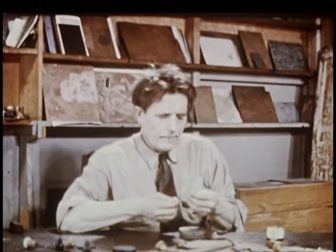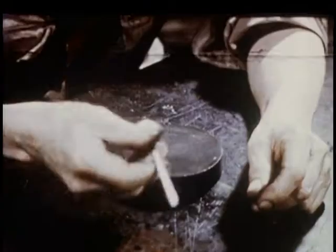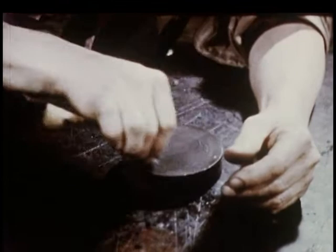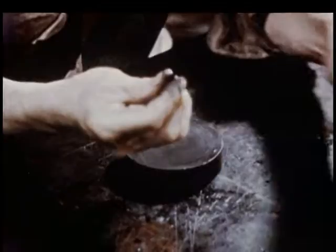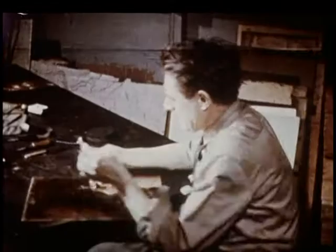The tools must be very keen. The undersides are ground perfectly flat on a stone, the edge between them razor sharp. The left hand presses down; the right only guides the tool. The end facet is ground at 45 degrees to the stem, round and round to avoid shifting the face — the wrist is stiff. Check the angle: two burins together make a right angle.